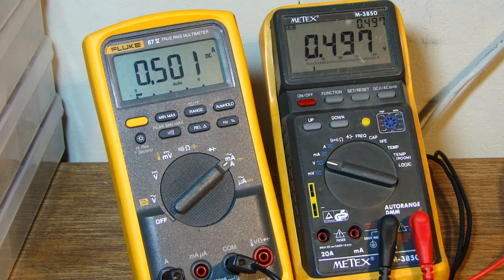Realistically, if I replaced the 10 ohms with 22 ohms and put 22 of them, I could in theory get 12, 15, 16 watts, which would give quite a good load. The actual limit I've set at the moment from the voltage generation is 2.5 volts, so theoretically it can pull 2.5 amps. But if I did that, I'd just blow the resistors to kingdom come.